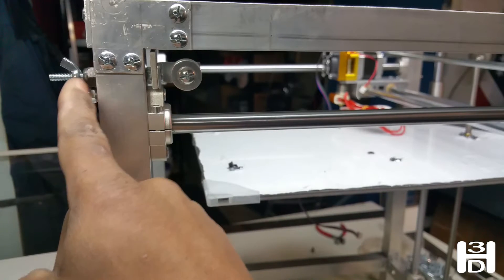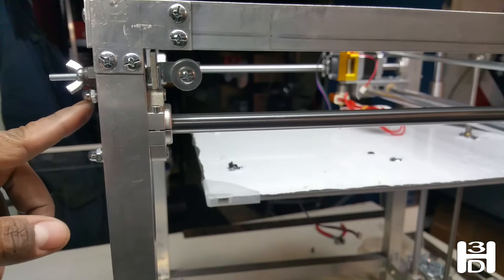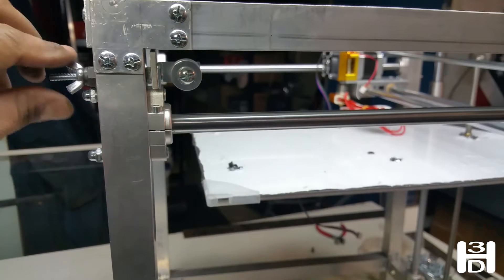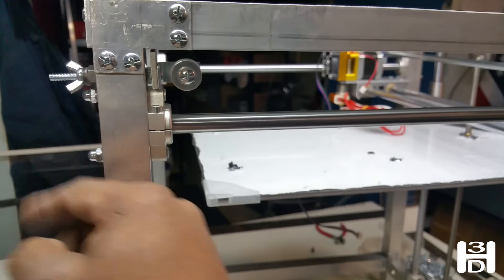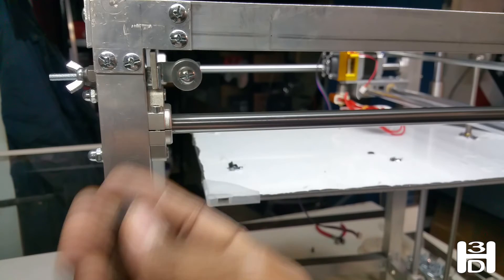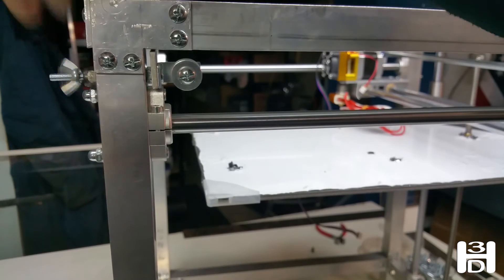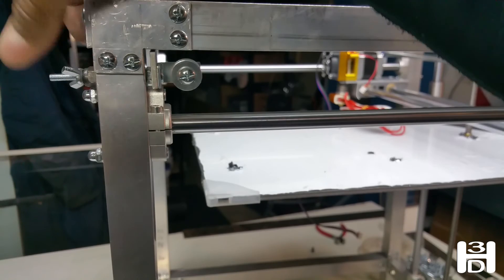You can use anything you want as a spacer behind the wing nut. The spacer is there to make sure that your cap nut for the SHF-12 does not interfere with turning, so as long as your spacer is long enough to keep the wing nut from interfering, go for it. Right now I just have a nut that's larger than the screw and it acts as a spacer. You can stack washers, or once you have your printer up and running and tuned in, you can even print out some bushings or spacers. So that's how that assembly goes.